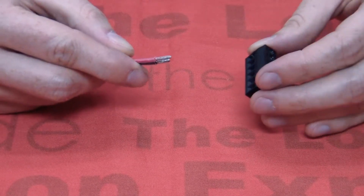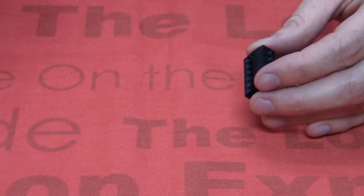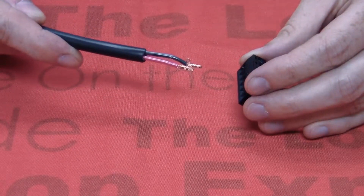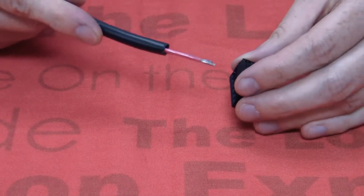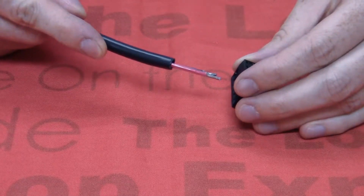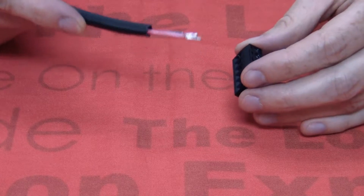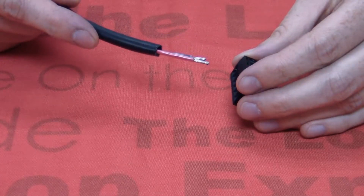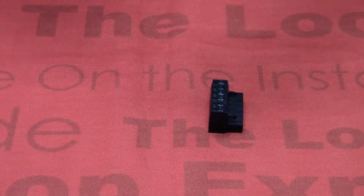In our experience, it is very easy to pull bare lead-in wires out of a screw-down connector and nearly impossible to pull tinned lead-in wires out. This is something we demo at our training class sessions and always takes installers by surprise. So let's go ahead and demo that real quick.